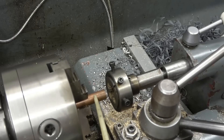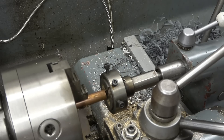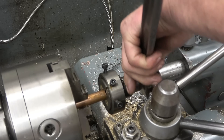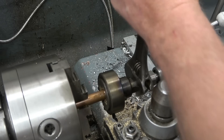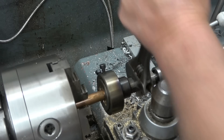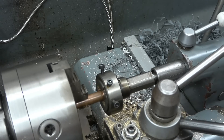This pipe's thick enough to be able to put a thread on the outside of it. A 3/8 BSP is the size I want to fit into the union on the valve, so hopefully we can cut a 3/8 BSP thread on here, which means we won't have to braze or solder it into a fitting - screw copper, that's the way plumbing used to be done.